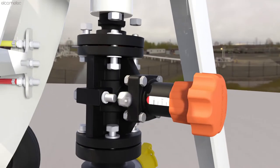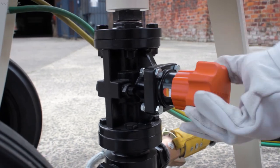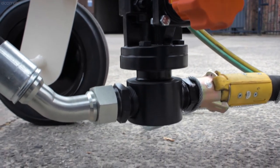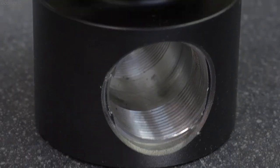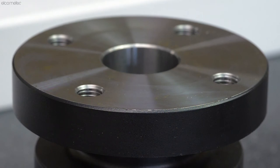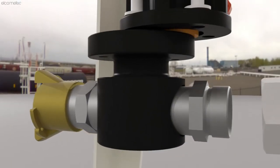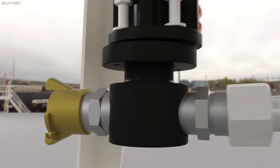While you're blasting, the valve's integrated scale clearly informs you of the valve setting to help keep you in control. The mixer T, where the high pressure air mixes with the abrasive media, is made from ultra-hard wearing machine tool steel, so it lasts longer than traditional steel versions. And when it starts to wear out, just rotate it by 180 degrees to double the service life.